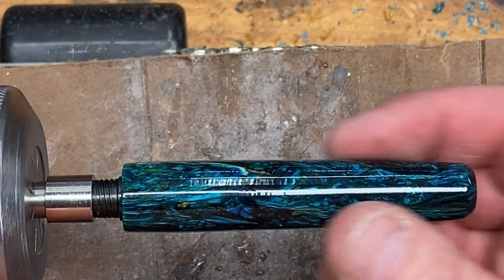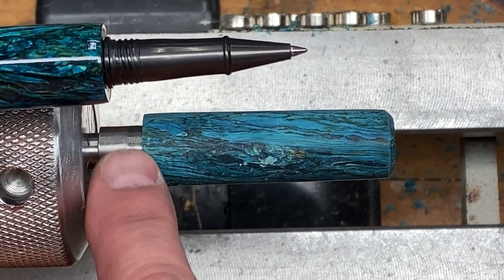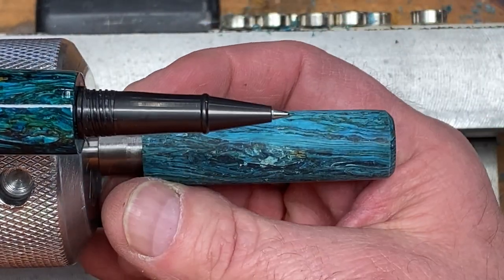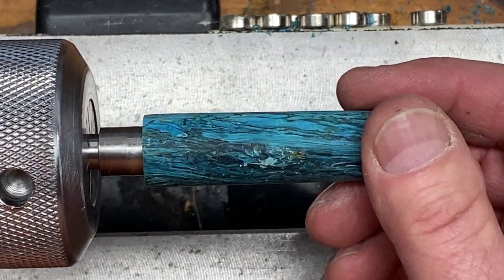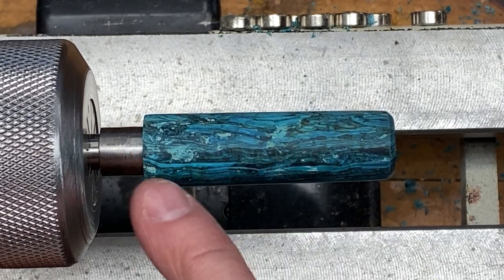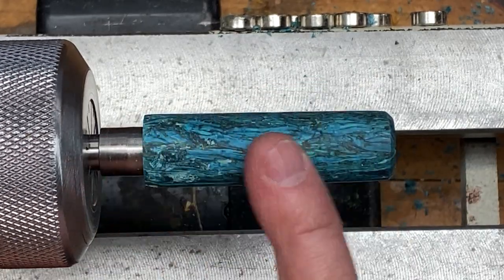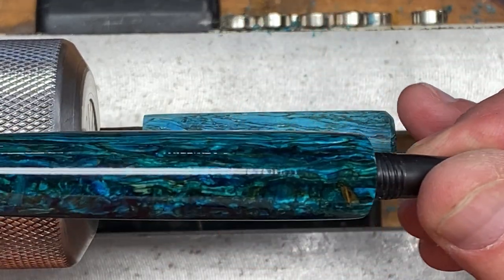I do need to put some wax on this — I'll do that real quick and buff it, but other than that, this body blank is ready to go. I've got the cap chucked up, and I want to chamfer just the outside edge just a tiny bit. I'd like it to kind of meet nicely with the body blank — if I could have about the same chamfer on both ends, the symmetrical aspect of it would be really nice. Those little spots will clean out and fill. We're going to do exactly what we did on the body blank — five and five of our CA, thin and medium, then sand it off with sandpaper and apply it again. That should level each one of those little dents, and it's going to turn out as nice as this body blank.